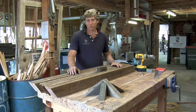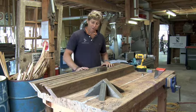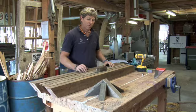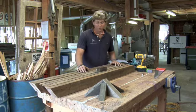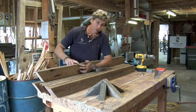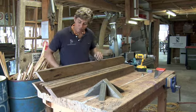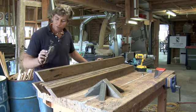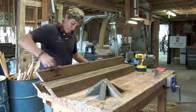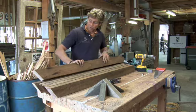If you happen to be using rough sawn timber for your veggie patch — like this recycled hardwood we're using — it's got a lot of splinters. One thing you might want to do to eliminate splinters and also give a more attractive appearance to the finished job is remove the aris. In woodwork terms, the aris is the sharp edge where two surfaces meet, and that's a good spot for getting splinters. The easiest way to remove the aris is with a block plane or a smoothing plane — you just run it along like that, and that eliminates the sharp edge and gives the job a much better appearance.